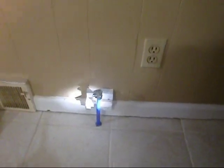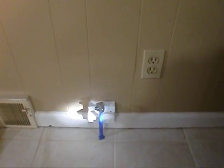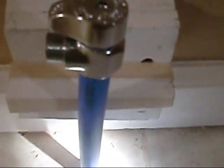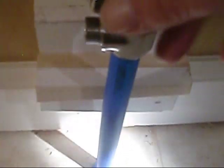Okay, y'all, I'm stubbed up through the basement there, and actually got it sleeved here with 3/4 inch PEX. It's sleeved right here. They said if you penetrate the floor, you need to sleeve it. And got my stop on. I've actually got this standing out so I can get my PEX tool on it to crimp it. And then I built it up with some trim here, some base, and that way you can actually turn the valve on and off.